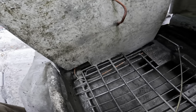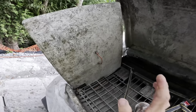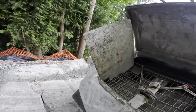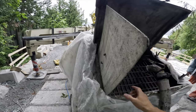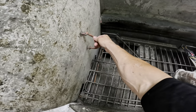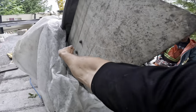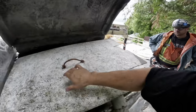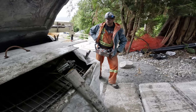I can jam the board right on the side of the hopper here. You've got a nice little splash guard, keeps concrete from splashing that way. So yeah, super handy. I just use a piece of nylon rope, drill a couple holes in the board, and tie knots on both sides as a handle. Best thing ever, or what?